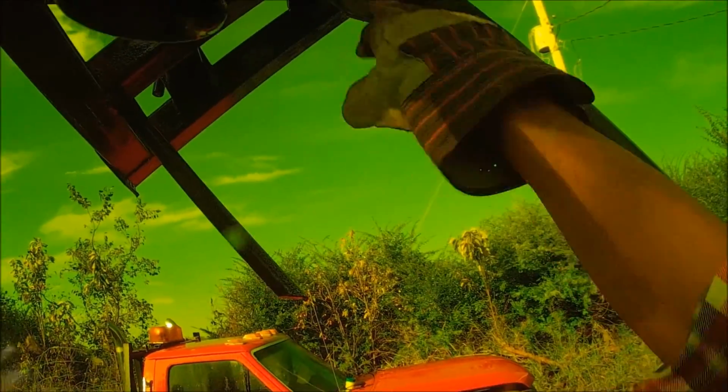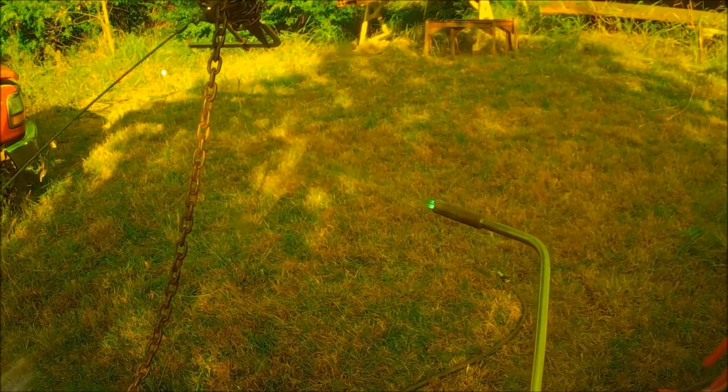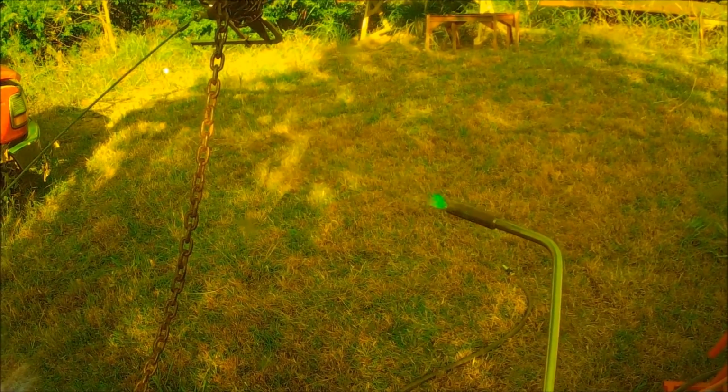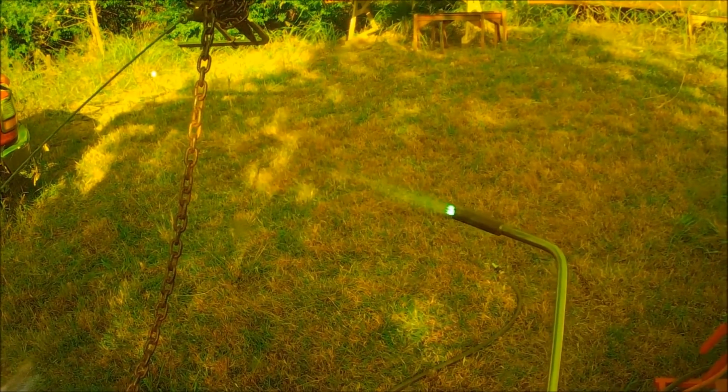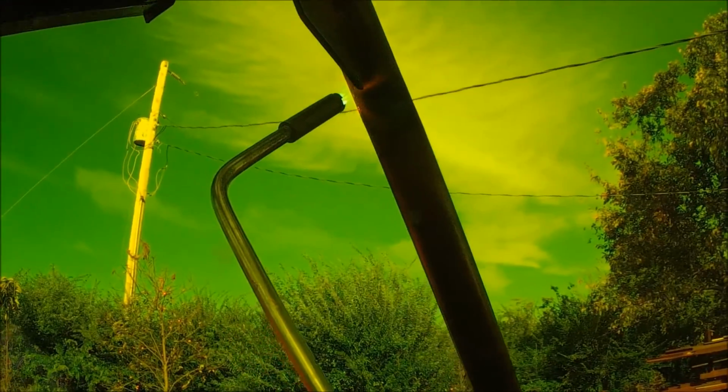Right now I'm into some places that are bent and some that aren't. I think probably back in here is where we need some heat. That's where it normally bends because you've got that strong back on there. So anytime you abuse that spike, that's where it bends, because it'll bend where it's braced. And it's right in there. That's where we'll heat it.